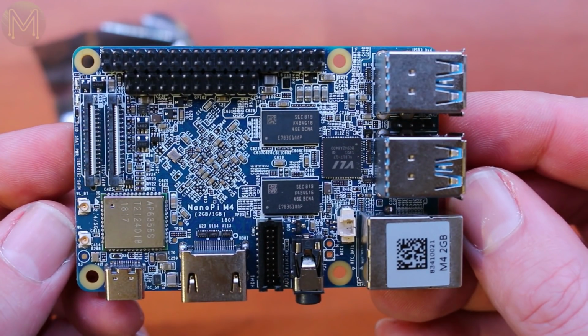Starting from the top right, working clockwise: 4 USB 3.0 ports, gigabit Ethernet, RTC header, mic header, audio jack, eMMC socket, HDMI, USB Type-C. Tucked underneath there's an SD slot and also MIPI CSI2 and MIPI CSI1 headers, a not quite Raspberry Pi compatible GPIO header, and a second header with SATA lines broken out.